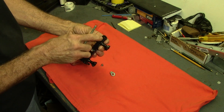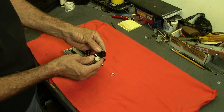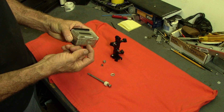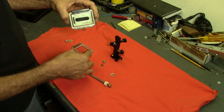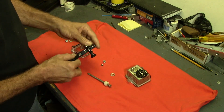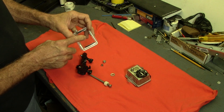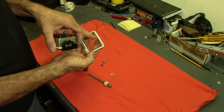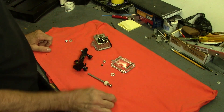This section right here I'll drill out to 1/4-inch, slide this through, and put a nylock - that's a nylon self-locking nut - on the other side. Just snug that a little bit and this will serve as the pivot point. Down here I can attach a big fat lead fishing sinker, or two or three, whatever it takes hanging down, and that will be my counterweight for the camera. First thing is to drill a hole up to a quarter inch in the center of this. When this goes on the back of the camera, I'll add a big piece of foam inside to push against the camera and hold it into the housing. That's the plan.